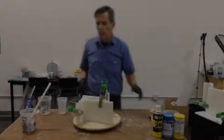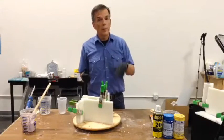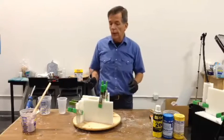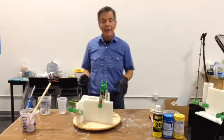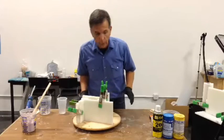Then you can cast the rubber over top of that, and once that cures, you're ready to cast the second half. What we've done here is we've eliminated not only the step of having to carve that clay, but more importantly, we've eliminated the step of cleaning the clay afterward — which is the part that truly sucks. Because if you get clay in the little cracks and crevices and nooks and crannies, you've got to take all that stuff out, or when you make the other half of the mold, you're molding the piece with the clay.